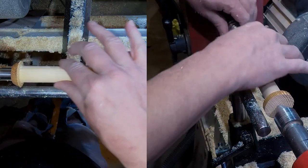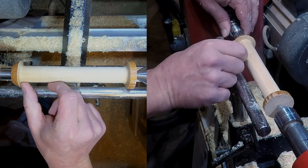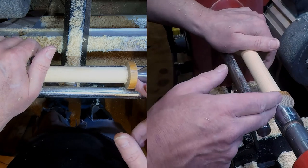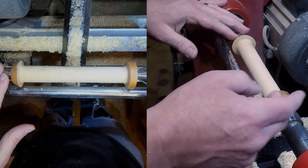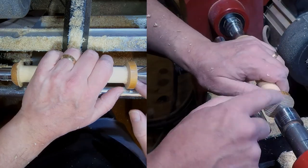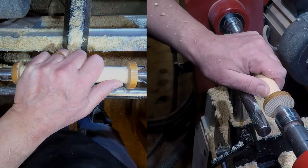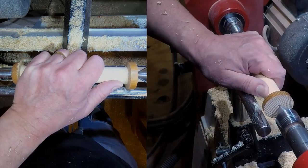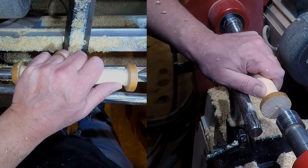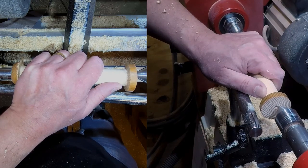Just got this trued up - it's still fairly thick. The handle will probably be about half the thickness of this and it's going to be fairly short. I haven't done any predefined mark points on here, because I'm not really going to alter this end - I've just got a straightforward sharp point on this end and it's softwood, it will sink in nicely anyway. So I'm just going to take this out and put it off center by a very small amount - probably about three or four millimeters.